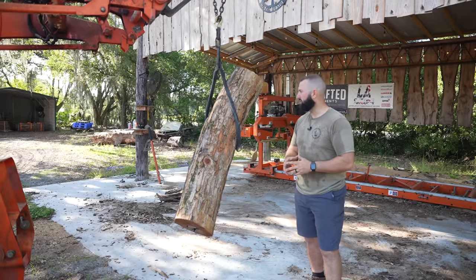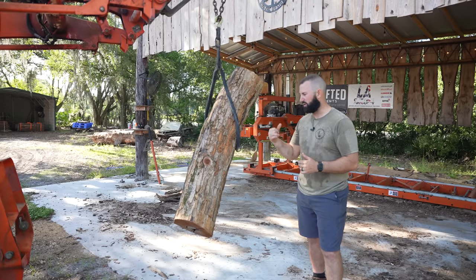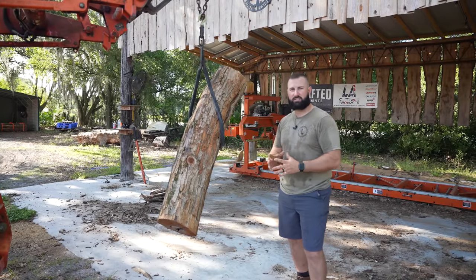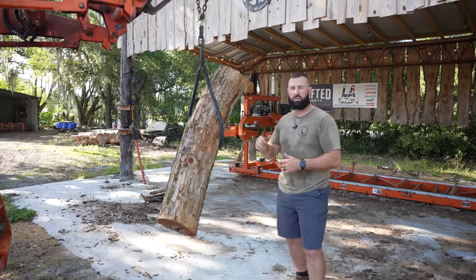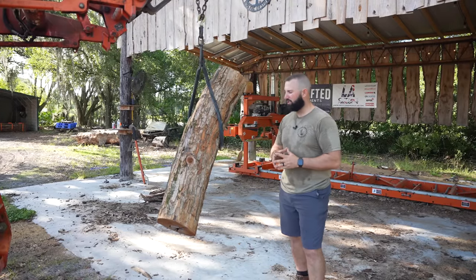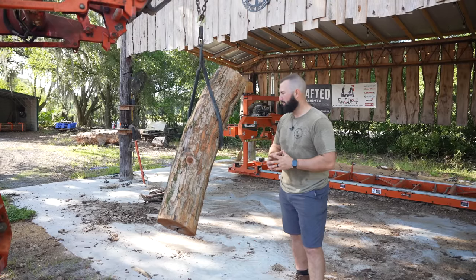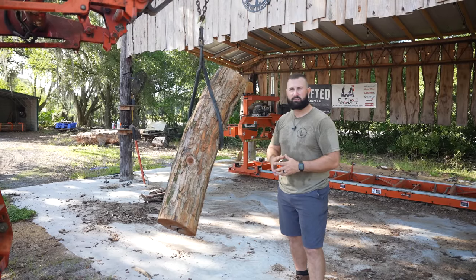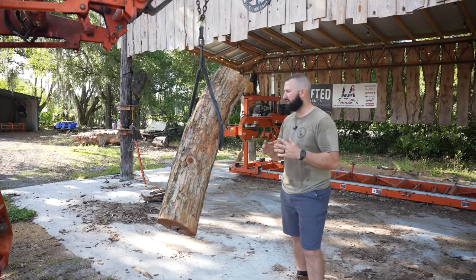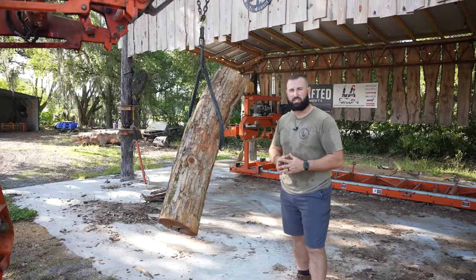That should make it nice and simple because that depth scale accounts for the kerf that you lose when cutting these logs. Everything I've read about Osage Orange is that it's a very dense material. Today we're gonna be using our Wintersteiger blades from LA Cutting Products, and hopefully it should handle it pretty well. I'm pretty confident in those Wintersteiger blades, but this wood is what they use to make bow and arrow handles, tool handles, anything that needs a good solid wood. That's what they use this Osage Orange for.